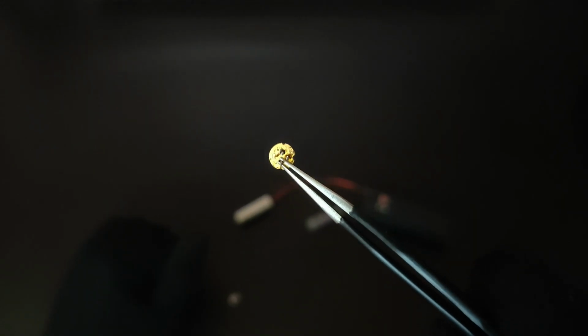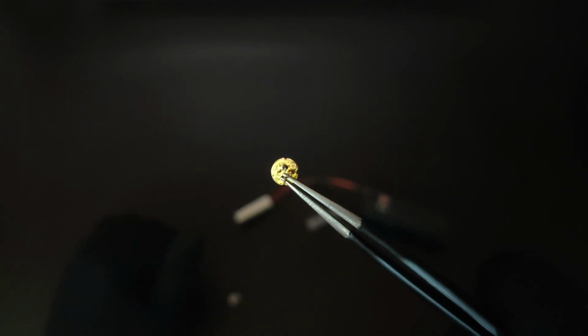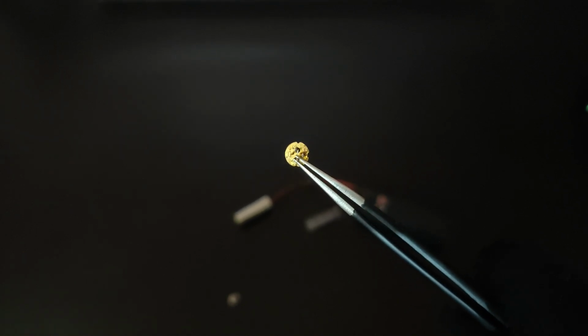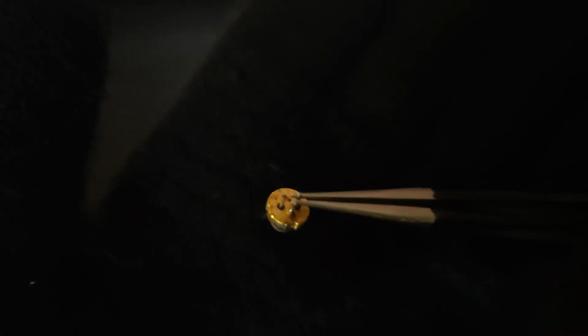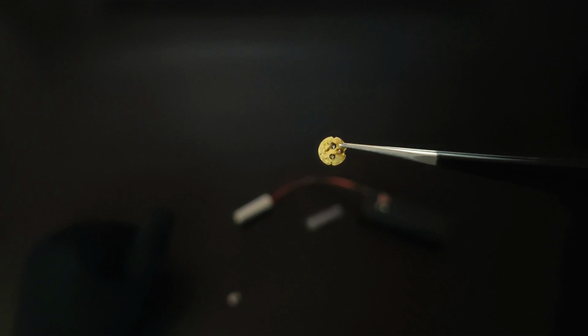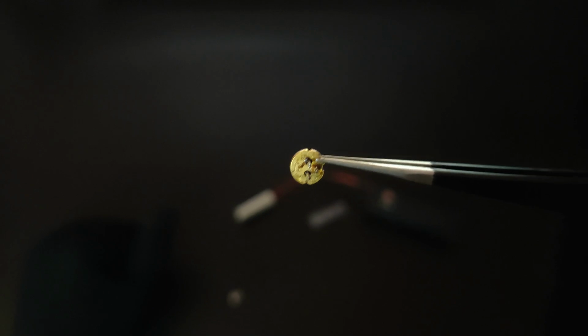Before you connect the diode to the driver, you're gonna have to figure out its polarity. Now, most diodes manufactured in this form factor are going to have their positive pin at the top and the negative in the middle when you hold the diode in this orientation. If you take a close look, the negative pin is merged with the casing of the diode. With a multimeter in continuity mode, you can connect the negative probe to the casing of the diode and then touch all of the other pins with the positive probe. When you get the polarity right, you should see a faint red glow coming out of the diode.